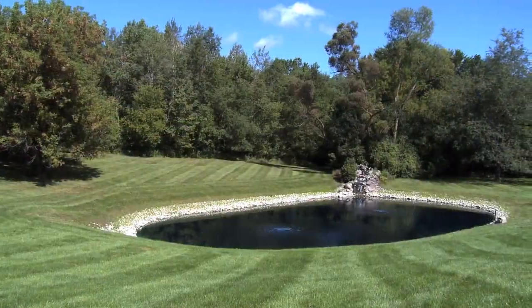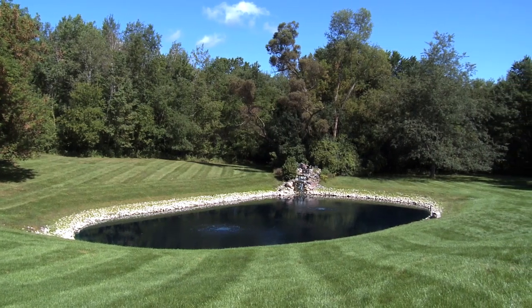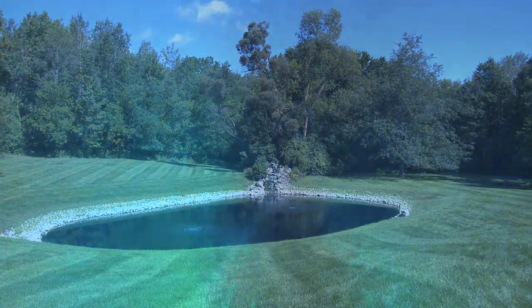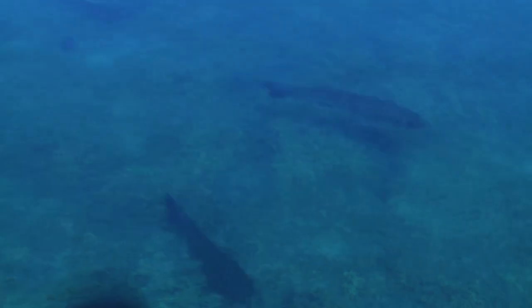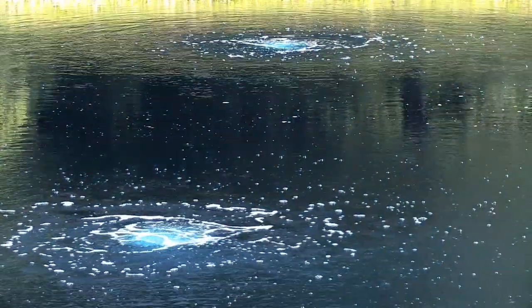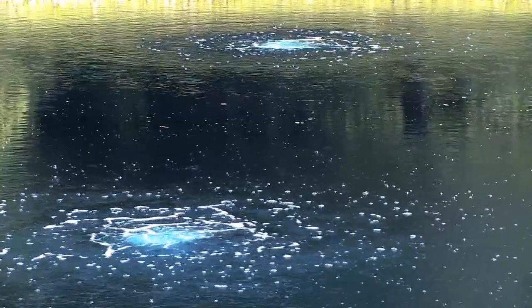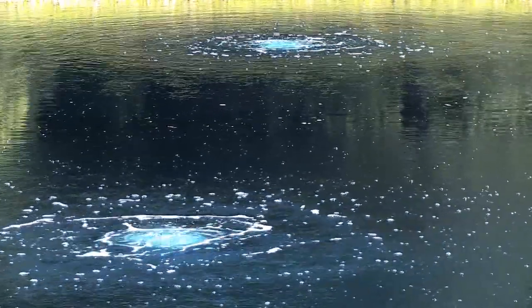Depending on the condition of your pond and the time of year you are installing your system, you may need to slowly introduce your Airmax system to your pond. If your pond is severely stratified, you may bring the toxic water from the bottom of your pond to the surface too quickly, causing your pond to turn over, resulting in fish stress or loss. Your pond would be most prone to this turnover effect during the warm summer months. If you notice an odor after turning on your system, or see a difference in the water color around the diffuser, your pond is more than likely stratified.